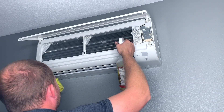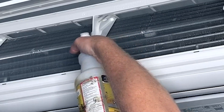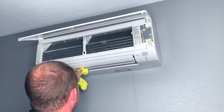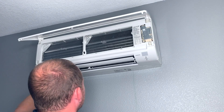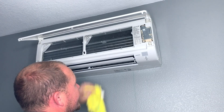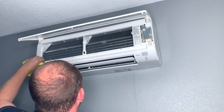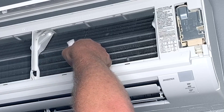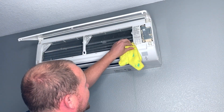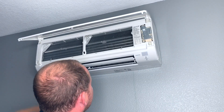Then treat the bottom row and the drain pan. I start on the far side because the drain outlet on this unit is on this side, so I start furthest away from the drain outlet and work through. On ductless systems this stuff is great, and in restaurant applications — anywhere it's kind of mission-critical and you need to make sure you're not going to damage anything or have caustic fumes — both of these products are really great for that. They're very mild because they are enzyme-based, working on those live organisms over a period of time, and they don't have a strong odor.